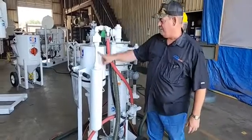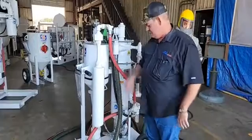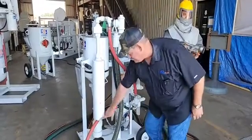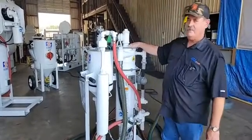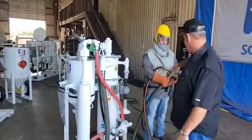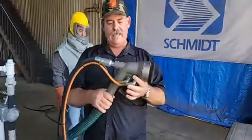This article here is called an eductor — it's a pneumatic vacuum pump. Your compressor feeds air into this and out this diffuser, and that is what creates the vacuum on your dust collector, which in turn pulls a vacuum on the abrasive reclaimer, which in turn pulls a vacuum on the tip blast recovery head.